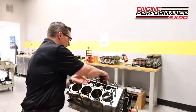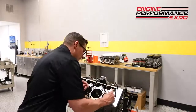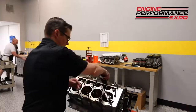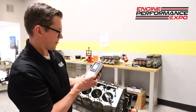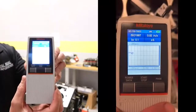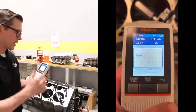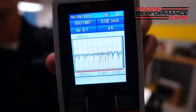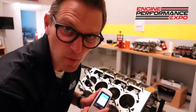Now we're going to use our handy dandy tool that Brad Lagman made. All we have to do is release the tension, rotate it down to an area that looks really nice and good, and compare the two. We'll hit start on the profilometer. So far looking real consistent and good — the scale is 200 micro inches. The key is that if it starts to get really irregular, it's going to jump off that scale. Has it killed the surface? It's not completely killed it, but it is definitely less than desirable.